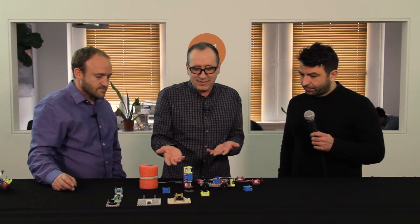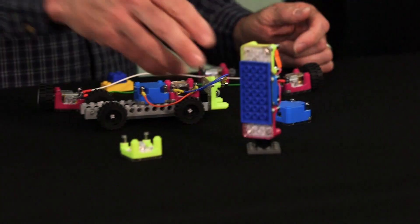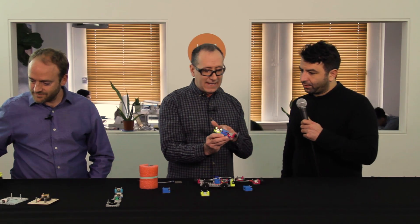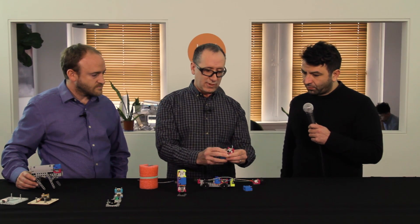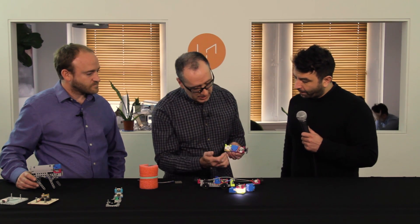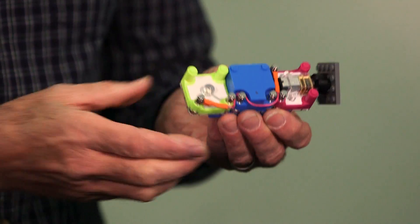One of the other cool things is the lighthouse. In Bright Lights, you'll also be able to make something like this — taking a couple of Lego pieces and three components to make a lighthouse with the light flashing around. The tricky thing is if I did this in parallel, the motor would spin too fast. So instead, I use a series connection: power comes out of the battery, into the light, through the light, out of the light, through the wire, into the motor, and that completes the circuit. That's why it slows down the motor and reduces the lumens on the light.